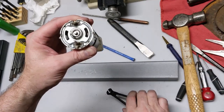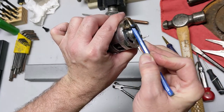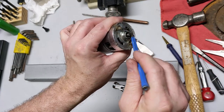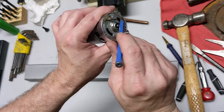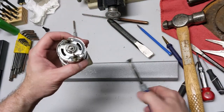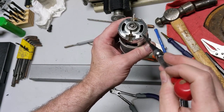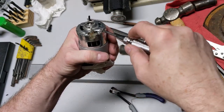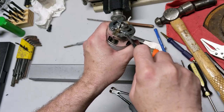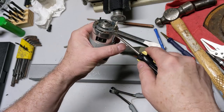Some of these are more difficult than others. It's a little bit harder to get a straight-on shot with the shaft and bearing housing sticking out of the end bell, but we can still get a good hit on it. Sometimes going across with some flush cutters helps. I did drill these holes out just a bit bigger so I could get in and pry. I've already worked on this side for a few minutes to save time on camera.